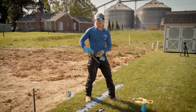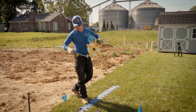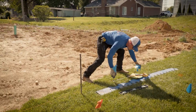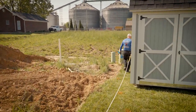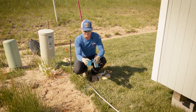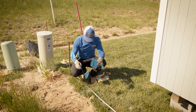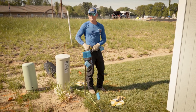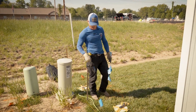From here going back it's supposed to be 48 feet. There's a sewer line in the back — it's going to be some hard digging and hard pounding. We're at 48 foot exactly where the flags are. We're going to gain six inches because these sections are six foot one, so technically we'd be 23 inches away from the marked cable line. The cable line deviates even further out, so we're going to leave it there.